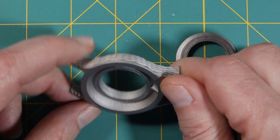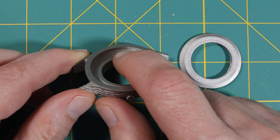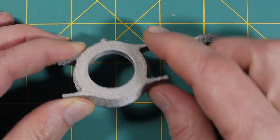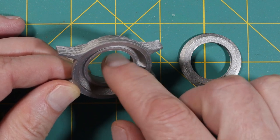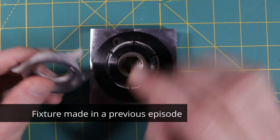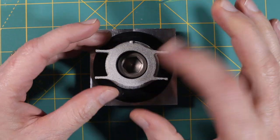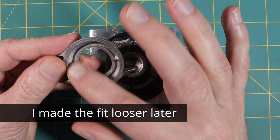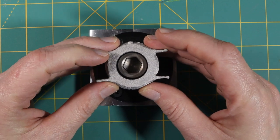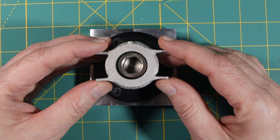There are a lot of operations. After looking at this for a while, I decided to start with an inside diameter clamp on this surface here — clamping down here so I can mill the back first, including the inside diameter. By clamping there, I'll have plenty of clearance to mill this inside diameter. Another thing to think about is how to clock this to make sure it's aligned correctly. There's a feature in here, so I cut a slot. This is a tight fit — I found some variation in the diameter, so it takes a little work and a hammer to get it started. But once it starts, the slot ensures it's pretty close to the right position.